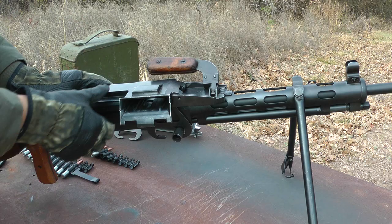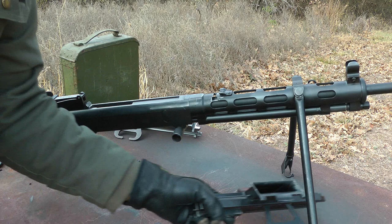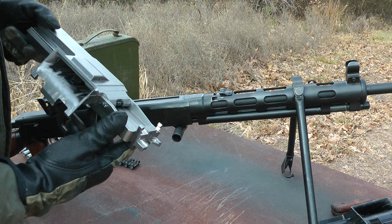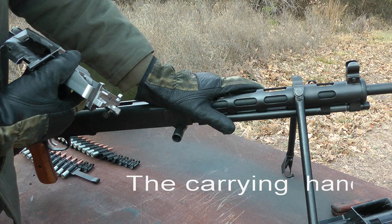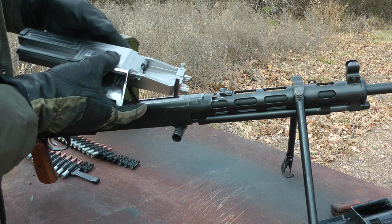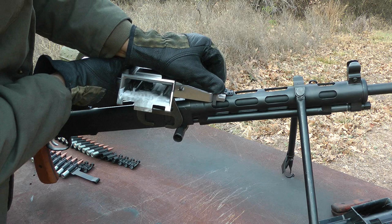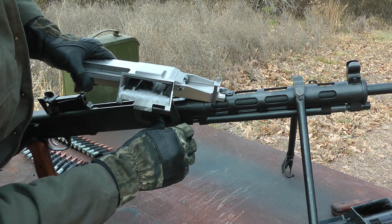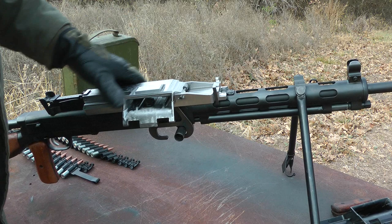I would like to present to you our top cover and show you how much easier it is. To do that, I'm going to take this one back off — pull the rear sight loose, unlock the carrying handle, pull the charging handle back to clear, and lift it off. Pretty simple. Putting our top cover assembly on is pretty much the same as the original with just a few changes. We now have locking tabs here so that you do not have to have a modified barrel jacket or barrel. We also changed the latch design in the rear so that it locks down and stays down. Set it in position, open the teeth, slide it up under the front mag catch, pull the charging handle back to go inside the actuator, set the cover down, and snap it into position. Now, no matter what you do, it is locked down solid — it cannot come off.